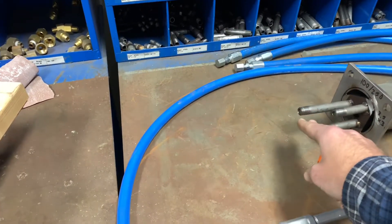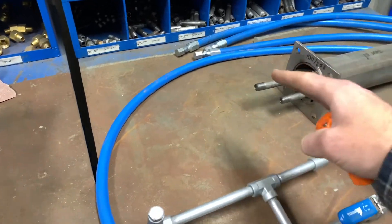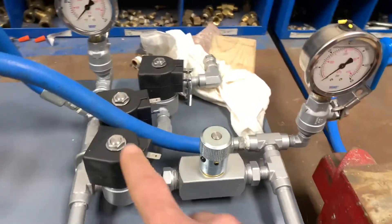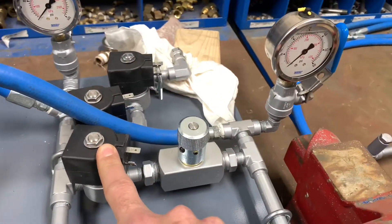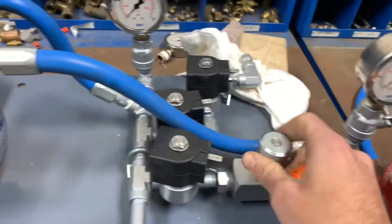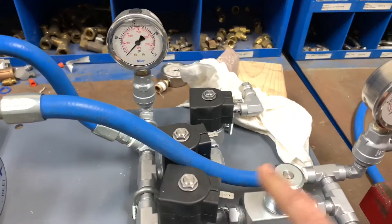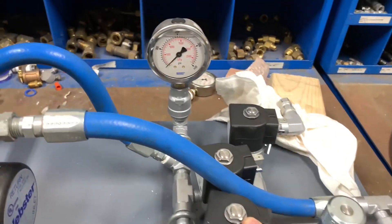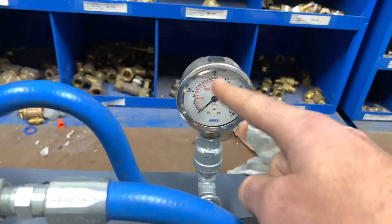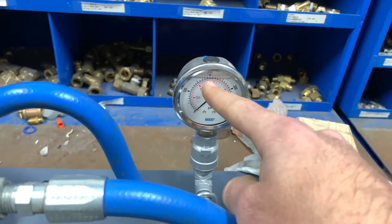This was common on older systems, but on new systems we just utilize all three nozzles for both low and high fire, just with different pressures. Regarding the bypass solenoid, there is a needle valve for adjustment — with the bypass fully closed, the pump discharges at maximum output pressure, which can range from 160 pounds all the way up to 250 pounds.